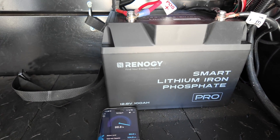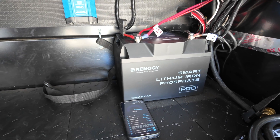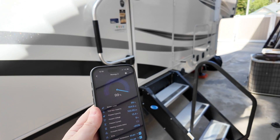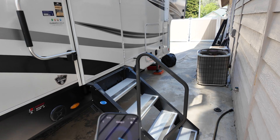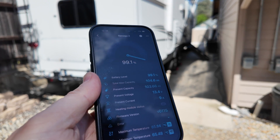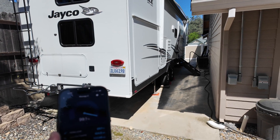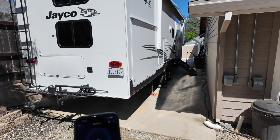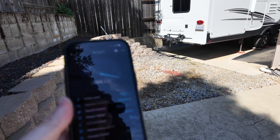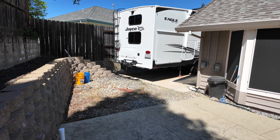It's just a nice feature having Bluetooth in the batteries — something you're going to start seeing in more and more product lines, both cheap and expensive. We'll do a range test to see how well the Bluetooth works. For my use case, it just needs to work inside my RV trailer. We had a connection at about 20 feet with the door open, still connected at 35 to 40 feet at the back of the RV with a lot of obstacles, and it disconnected at about 50 feet from the door.